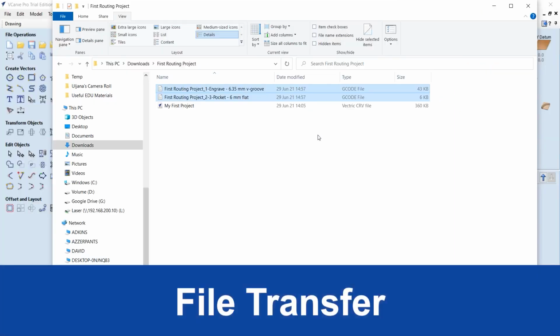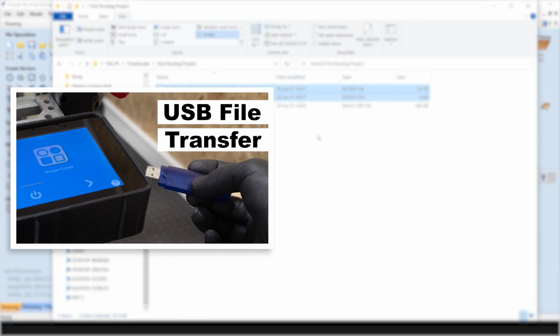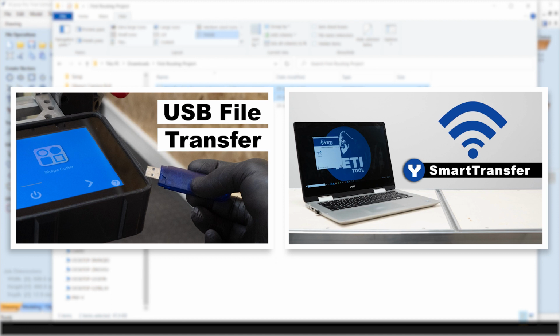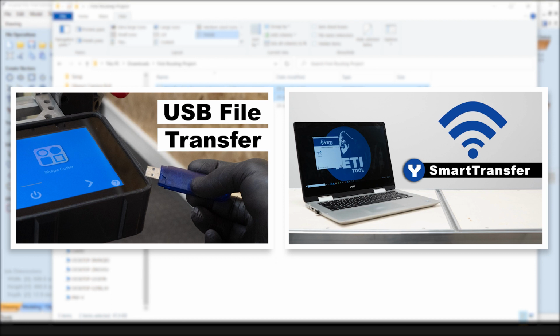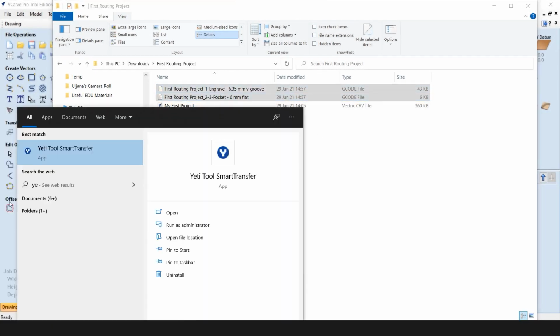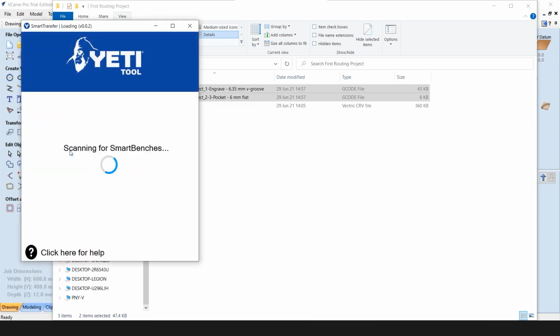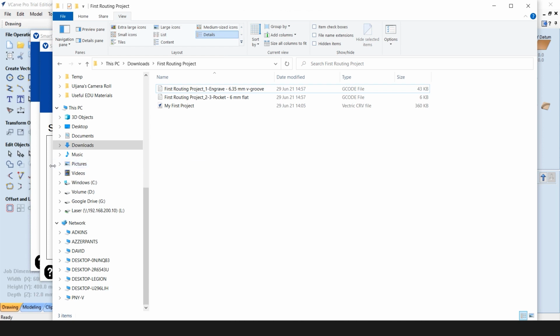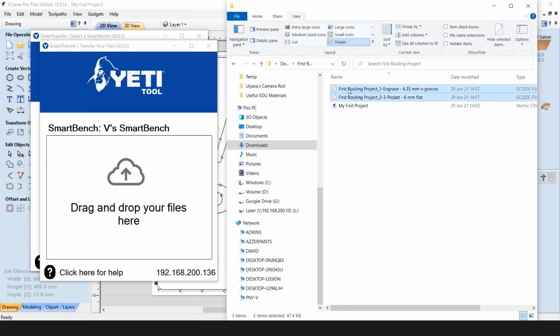Now these files can be transferred to your SmartBench. There are two ways in which you can do this. You can use a USB stick, or you can transfer via Wi-Fi using FileZilla or our Yeti Tool SmartTransfer app. For tutorials on both these methods, please watch the videos linked in the description. For this project, I will be using the SmartTransfer app. It will scan for the SmartBenches available. We will choose the machine we will be using, and just simply select the job files and drop them onto this window. The status of transfer is success. So now we carry on with the actual operations on the machine.